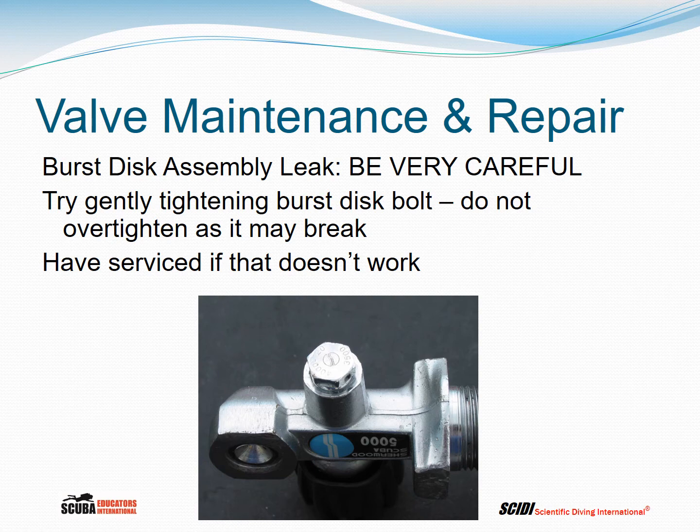It is designed to let gas come out so that it will vent this way and that way, instead of straight up out of the top of the valve, which could potentially knock the cylinder over if there was enough force coming straight out. So they lowered the diameter of the holes and made them go laterally. Try tightening that with a wrench, but be very, very careful.